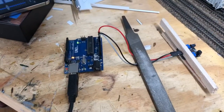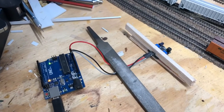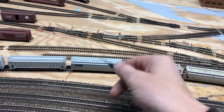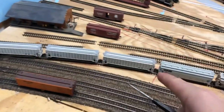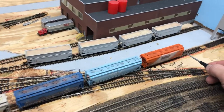I was originally going to go with a buzzer, something a little more obnoxious, but a light is a great way to watch while backing up the train. Also, if in the future I use different length cars — a 70-footer, then a 40, then a 50 — the train length will change. Right now I can fit 12 hoppers in there, but couplers vary in length and if I put other cars in there I can't just say '12 cars' because the total length will be different.